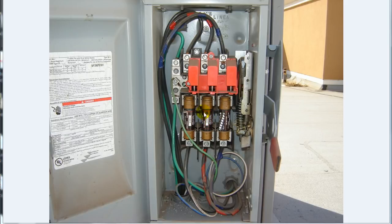If you take a look over here, it's got torque specifications and a bunch of other information in here. But mostly in general, I just wanted to show you about the grounding on that ground screw. A lot of people forget to put that ground screw in there that bonds that bus to the cabinet of the disconnect, and to point out these fuses and the labels so people can read them. So just kind of a quickie there.